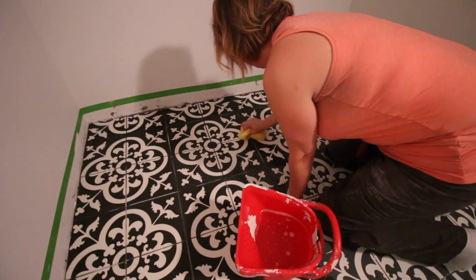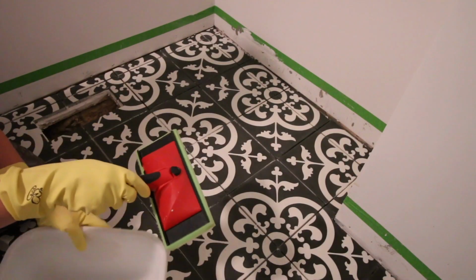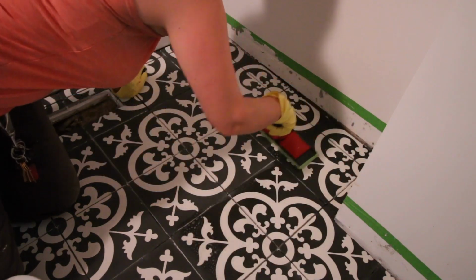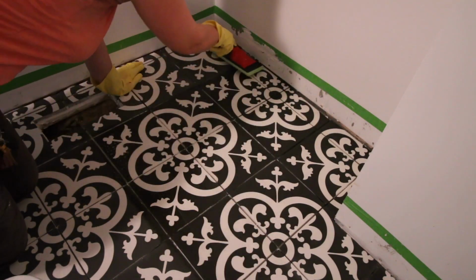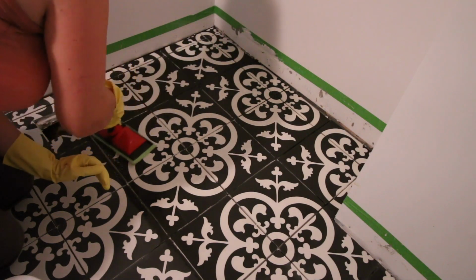We've arrived at the most important step when dealing with cement tiles. Make sure your tiles, and the thin set for that matter, are completely dry. You must seal the tiles before grouting them. Use a penetrating sealer made for porous stone or cement tiles. Apply the sealant in thin coats and remove any excess sealant off the tiles before it dries. Allow the sealant to dry completely before applying the next coat, and be prepared to apply many coats before your cement tiles are fully sealed.